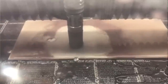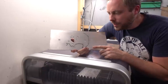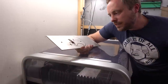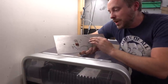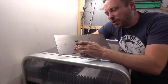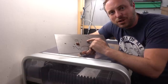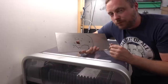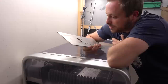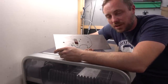It's going to punch a hole through the metal and cut this thing out. If you watch my channel, you know I include my failures — I screwed up. I read through the manual and found out that there was maintenance that needed to be done on the machine before I started this cut, but I hadn't done it, and I may have bumped the power button when the machine paused for me to refill the abrasive. I reset the machine by accident and only got halfway through this cut, so I have to cut another one.